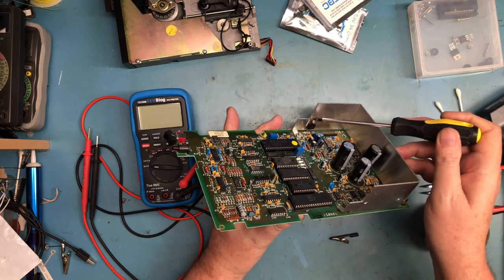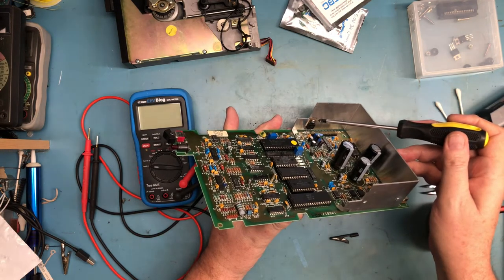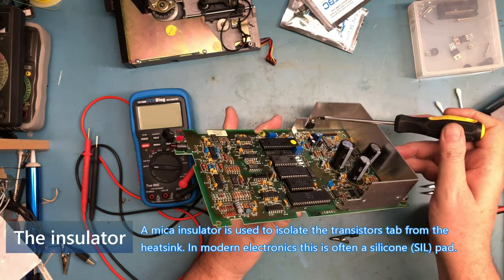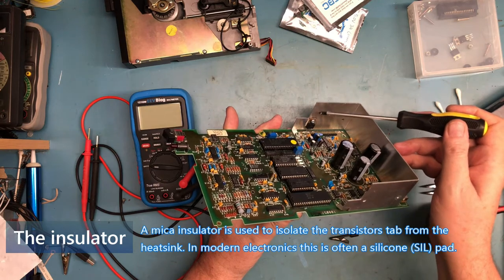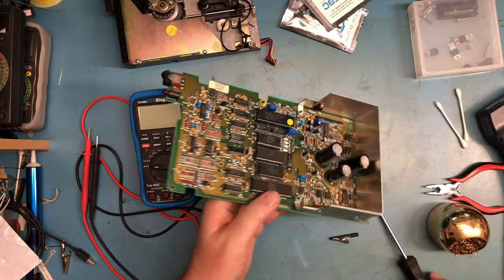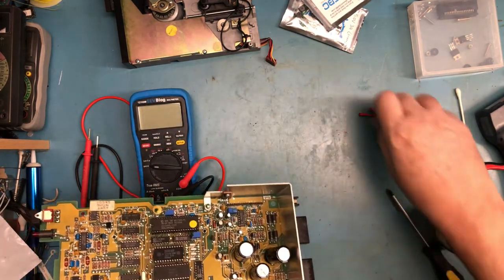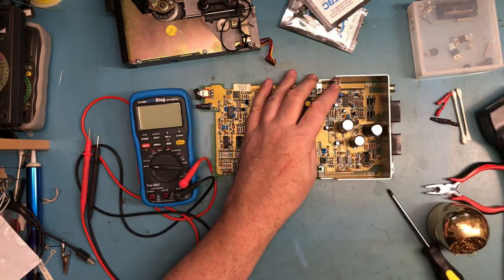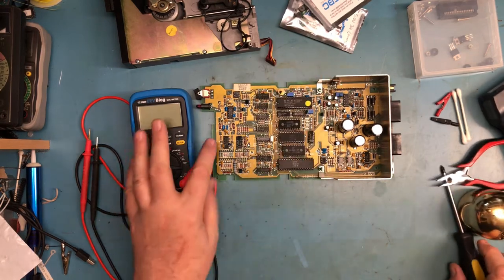and then the mylar back here, it's not mylar, is it? It's actually a, I don't remember what it's made of at the moment, but it's not mylar. And you have this little insulation tab here, insulating that tab also from the metal here. And that way, there's just no connection. And there doesn't need to be, in this case. So, if you do this, be wary of that. If you tear everything off, be sure you put this back together correctly. Make sure that you don't actually short the tab to here. You will have problems if you do that.